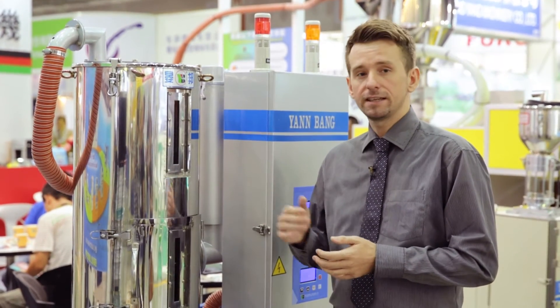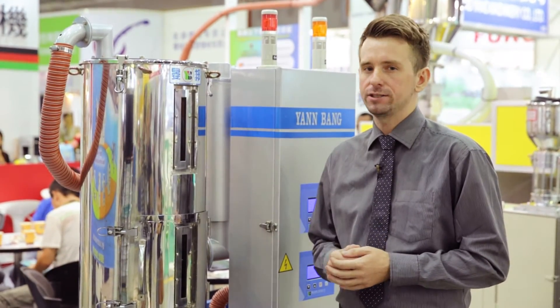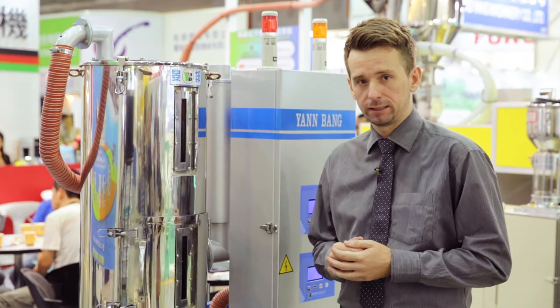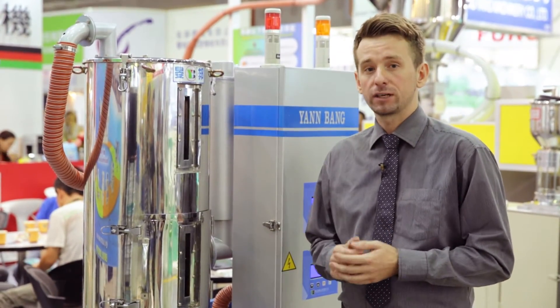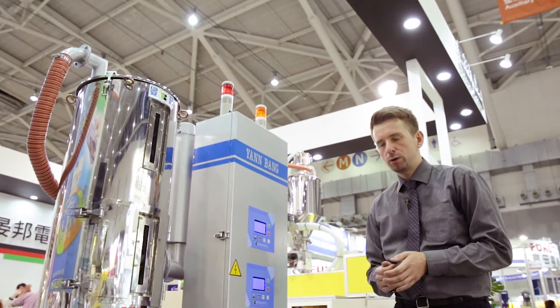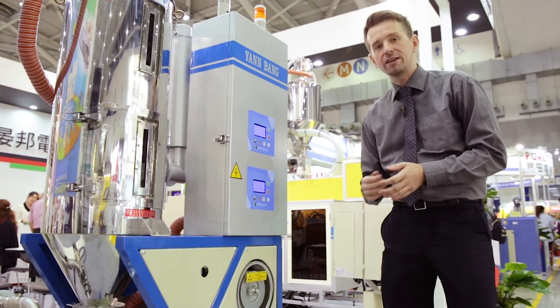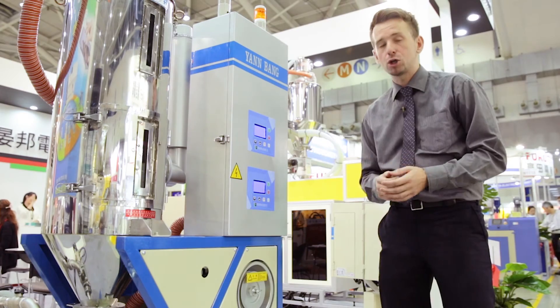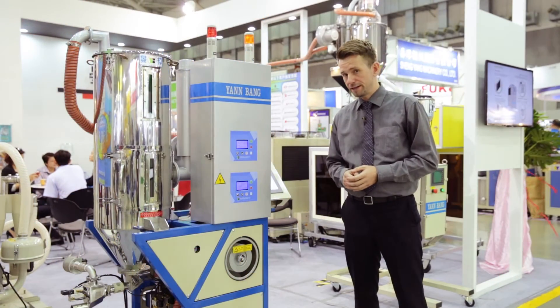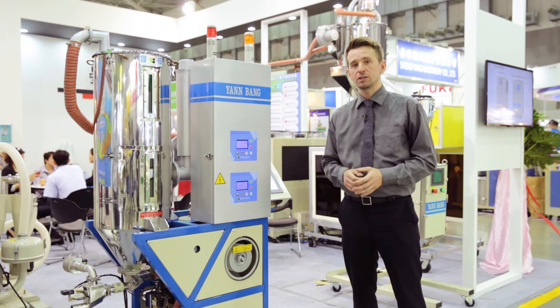Here you can see that this machine is equipped with stainless steel tanks, so its primary applications are in the optical and medical industry, and therefore this machine is also very suitable for clean room environments. If we look down here, we see the circular filter and a nice little window so the operator can easily tell when the filter gets dirty and then just change it out or clean it. As you can see, this conveying dryer is very compact and has a nice mobile design.